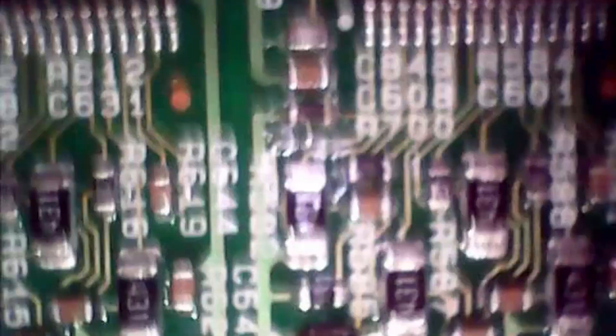The only other worry is this chip here - you can see where the protective coating on it has melted. There's no damage to the plastic; it hasn't got that hot that it's scorched the plastic, but clearly it has got very hot, whereas on all these others the coating is all intact. I'm just hoping it's only just got hot and it's going to be okay, but they are bespoke chips. Thanks to a couple of people who've said they've got 30 kilowatt BMSs, I've got a couple of replacements I could use. But I'd really like to get this one fixed - these components are literally pennies each and it'll probably cost me about 20 quid for someone to re-solder it, as they're a bit fiddly for me with my big chunky soldering iron.